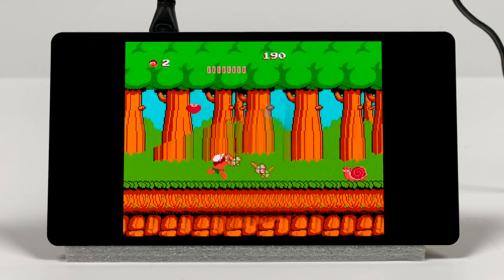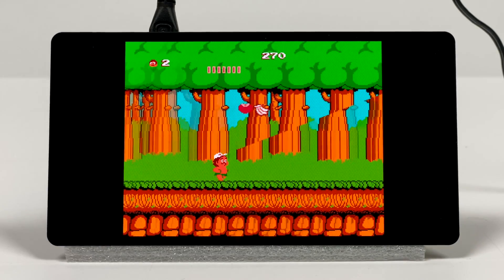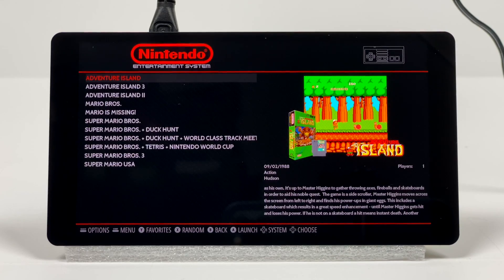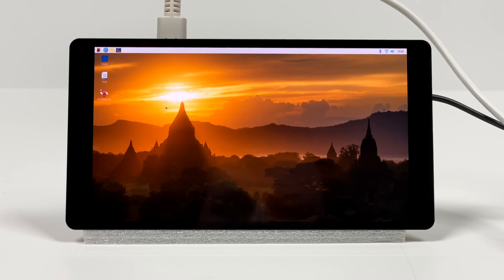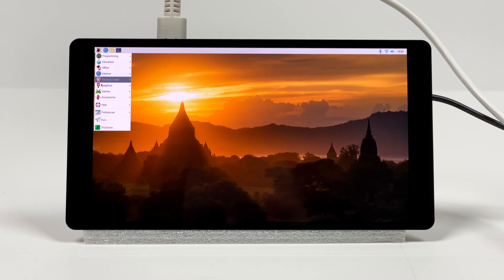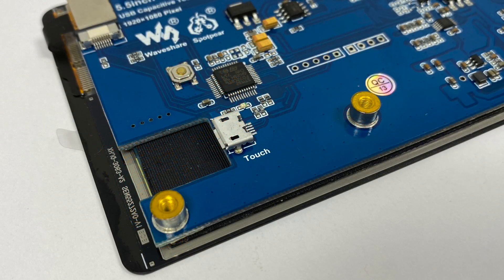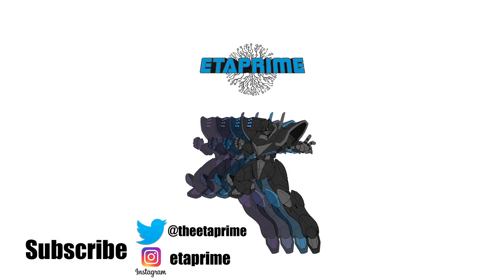In my opinion this would have been the ultimate screen for a little handheld. I love these AMOLED displays and with the form factor, build quality, and the way the screen looks I could have overlooked the $80 price tag — but the one thing I can't overlook is the performance. So if you've been looking at these AMOLED displays from Waveshare specifically for a Raspberry Pi, I would definitely stay away from it. Yes it does work through other devices with no screen tearing, but when it's connected to the Pi you just get really bad performance. I did try adding separate power to both the Raspberry Pi and the screen just to make sure it wasn't a power issue, but I was still getting screen tearing. So my search is still on for the perfect 5 to 5.5 inch screen for the Raspberry Pi. If you have any questions or suggestions let me know in the comments below, and as always, thanks for watching.